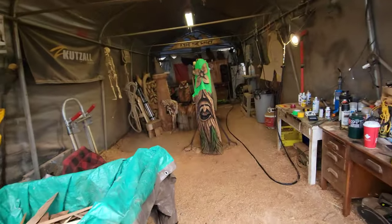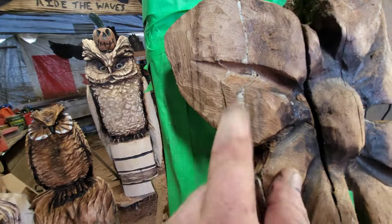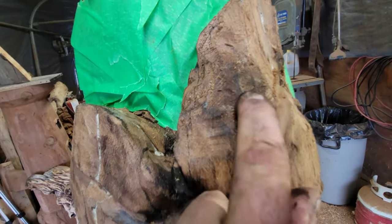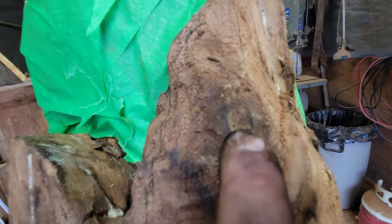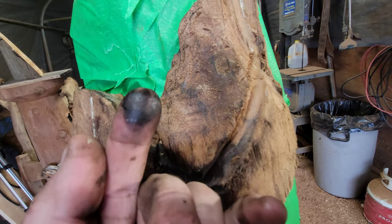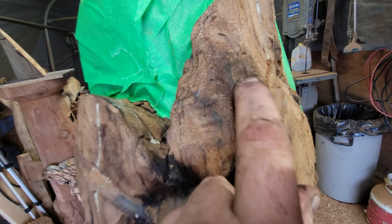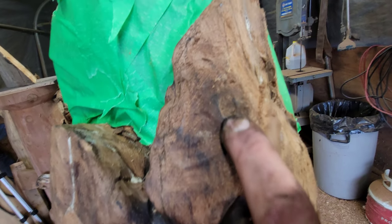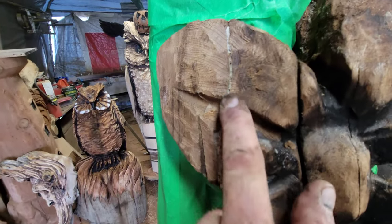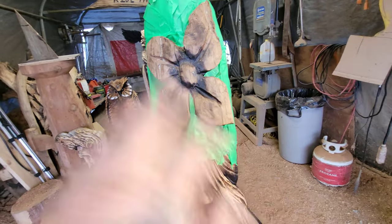So that glue is kind of dry. It's not 100% cured yet, but I sanded it off. I got 5 minute epoxy, and I mixed the epoxy with sawdust and filled those holes. Look, that Gorilla Glue, that's what it does to your fingers, and it will be there for a couple days. But anyways, I filled the screw holes. I left the screws in. I don't even know where the other hole is. You can't even see it. Maybe it's right there. But I got it taped off.